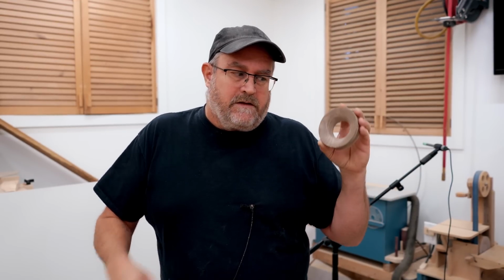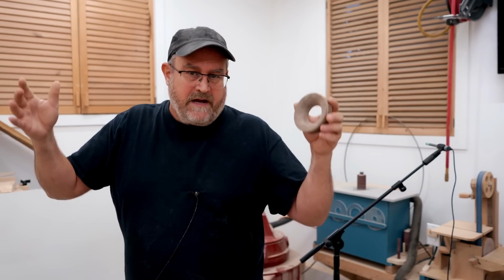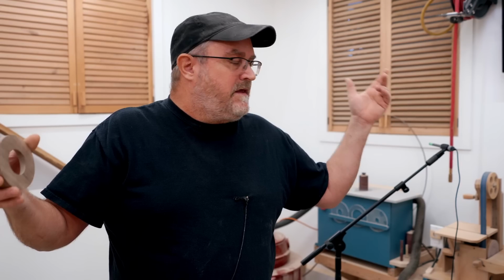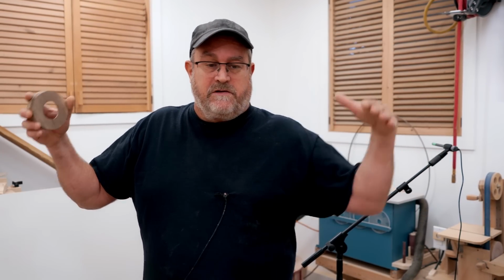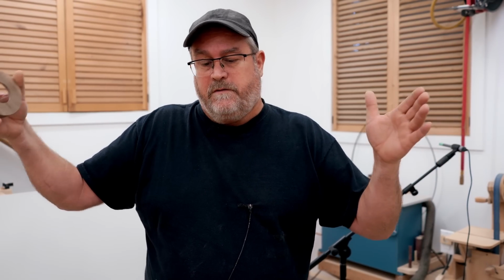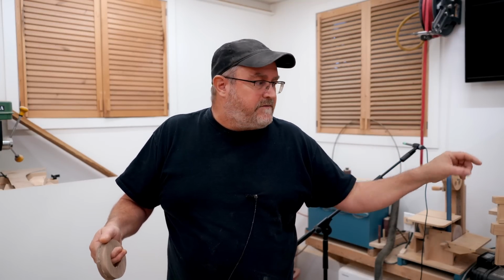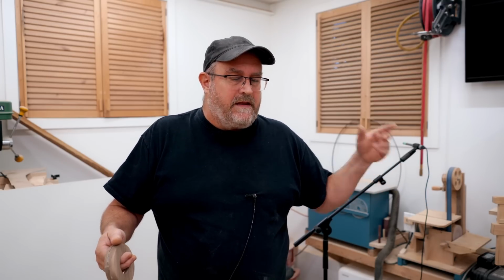The big thing that this does is it lifts the response in the lower range of the operating range of the thing that you're using it with, like a tweeter. And what that allows you to do is to actually flatten that out to match the other drivers, but it gives you more coverage. It'll allow you to cross that tweeter down lower, so it covers more of the frequency range. So I didn't make a recording on that one. I ran the sweep again after turning the amplifier down enough so that it wouldn't be clipping anymore, and that's what you're seeing here.